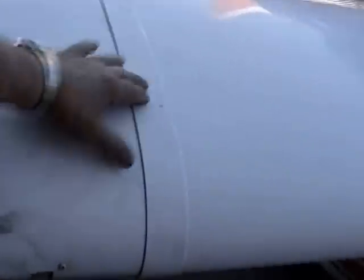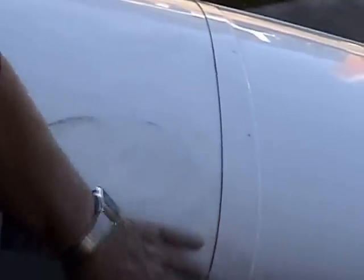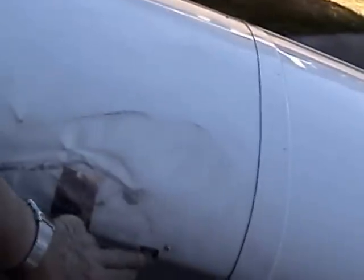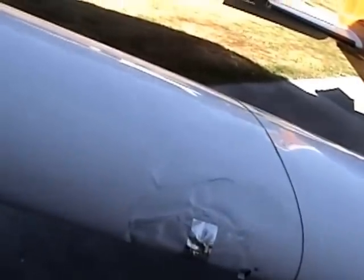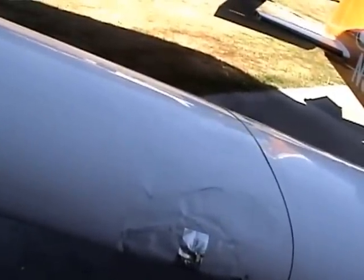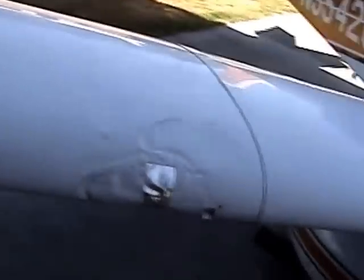and put it in. We'll have to flange over with the doubler here and doubler across there and across the bottom, and then lay over the top of this rib, and we'll bond and rivet according to the repair manual leading edge repair section instructions, and cut the hole here, put the stall horn and lift detector back in, and a little bit of filler over the rivets, and squirt some paint on it, put the strap back on, it will be done.